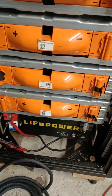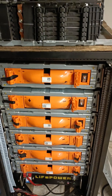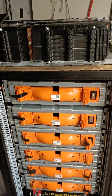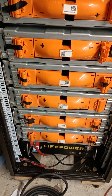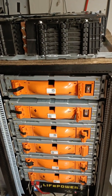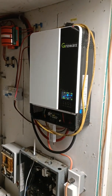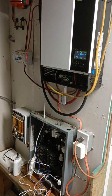I also have a 5000-watt lithium battery down at the bottom. Each of these seven orange ones is going to provide about two kilowatt hours, so with these seven I'm going to have between 14 and 15 kilowatt hours, and that bottom one will provide five kilowatt hours. All of this together should give me about 20 kilowatt hours. These lithium batteries go up through that 1-0 welding wire and connect into my 5000-watt Growatt inverter that pushes power into my house.